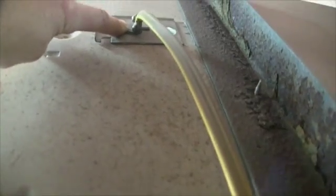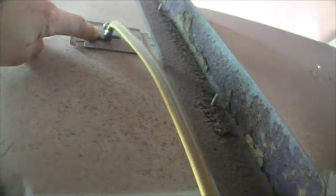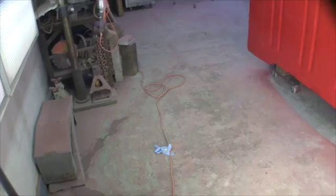For the wiring, I put a cable clamp in the outlet of each one of the backs of the lights and ran 14-2 Romex, wiring them together. In the bottom one is where I made my junction to put in a grounded electrical cord. It's plugged in behind the drill press — there's probably 20 or 25 feet of cord on this. I don't need any more than that or I'd trip over it, or I'd plug it into an extension cord.